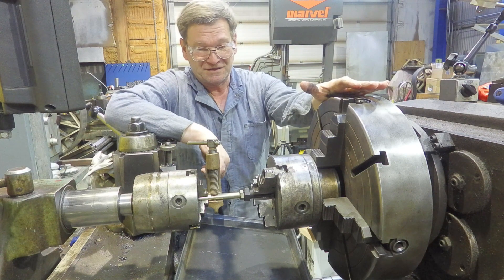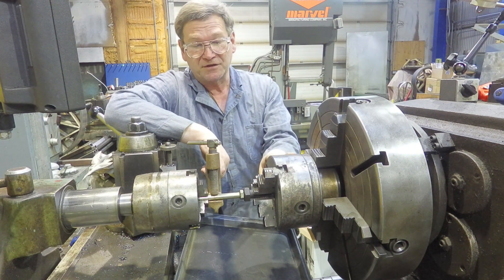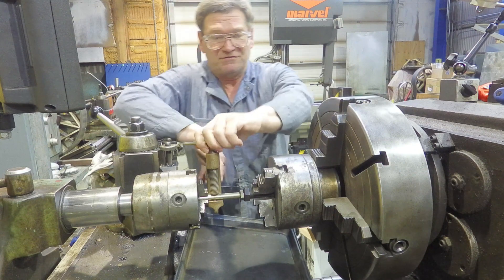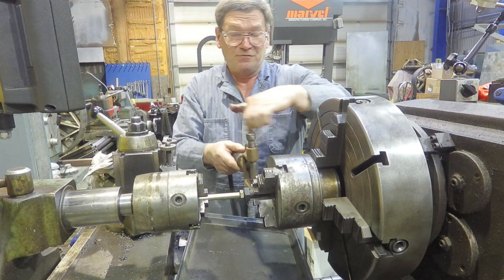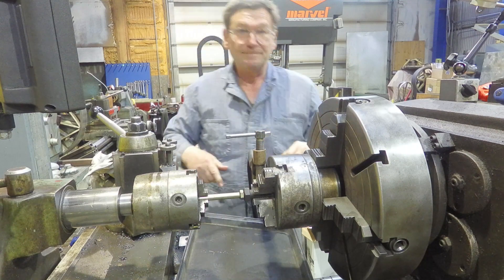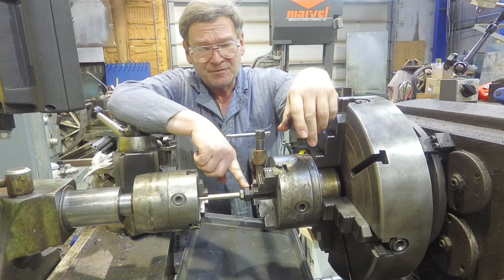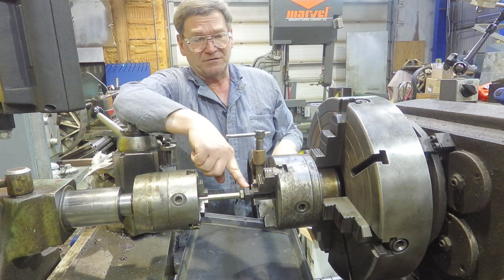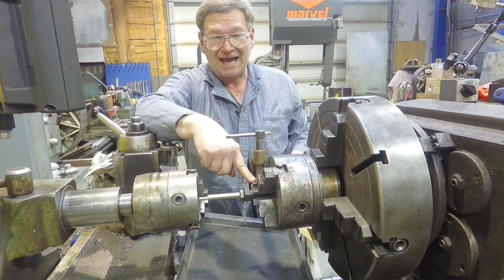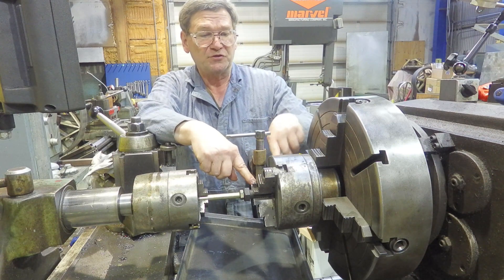We can do two things to make that better. One — which is a lot of bother — is to put two ground clamps on the machine, clamping here and clamping here. A lot of times you don't get the choice of clamping on your part; it's just too inconvenient. So the common thing you'll do, even though it's not as good, is clamp right on the chuck. Generally clamping on the chuck is okay for welding on this piece, but you still have some potential that a portion of the current will go through the bearings and find its way back through the machine.